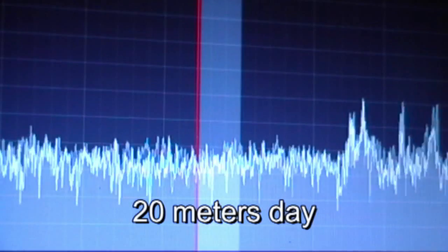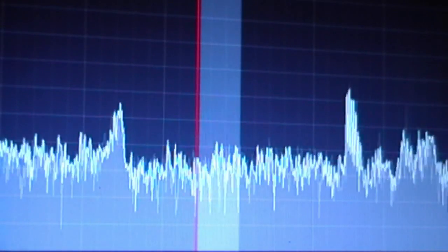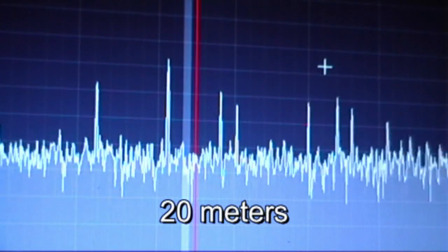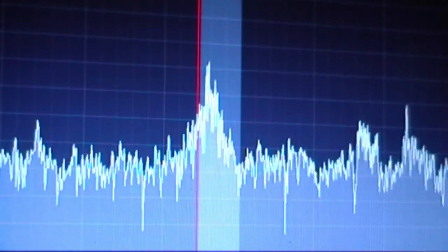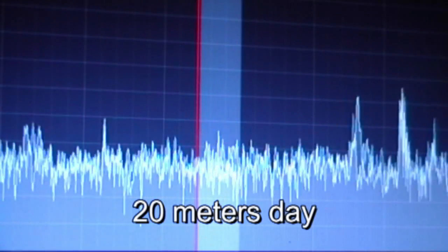There's the vertical on CW — you can see it's broad-banded. Vertical versus horizontal: looked a little bit stronger on the vertical. Here is a German station on the beam, then on the G5RV, then switching to the vertical — virtually no difference. Again G5RV versus vertical — virtually no difference. Listening to an Italian station on the G5RV, then switching to the vertical — looks a little weaker on the vertical. Now listening to the Italian station on the beam, switching to the vertical — he's a little bit weaker on the vertical. Very little difference overall.